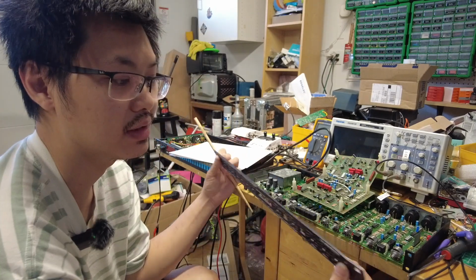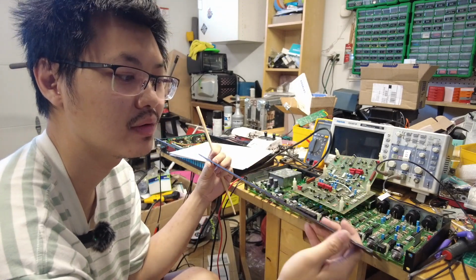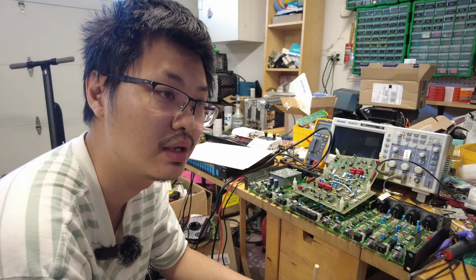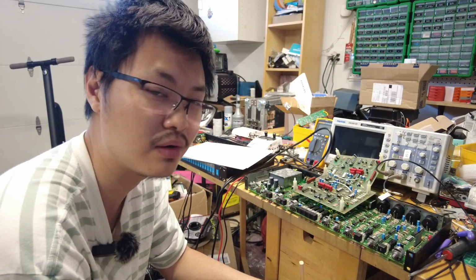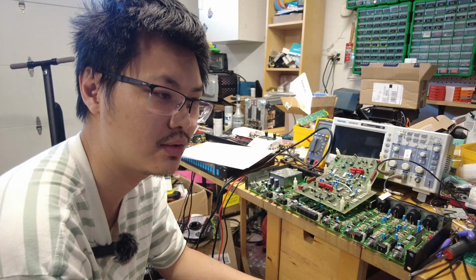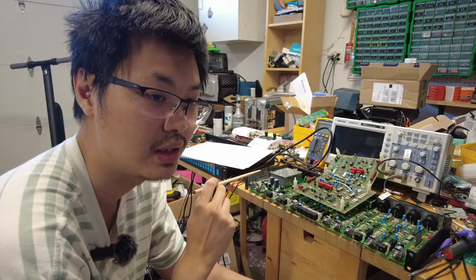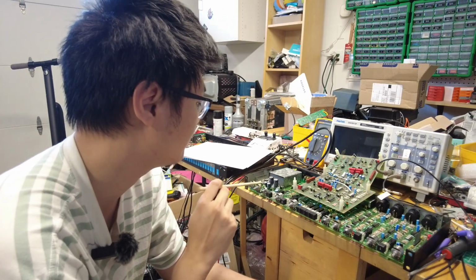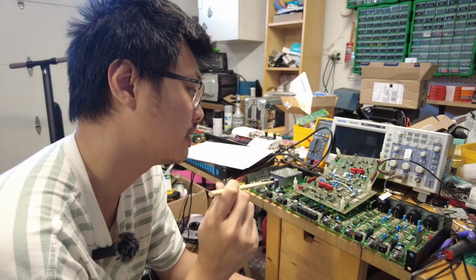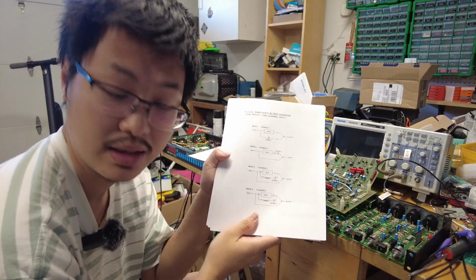When I received it, it was a little bit bent over here, so I have to straighten it up using the vise. So, pretty cool. Now Mike mentioned to me that the problem was the chorus is not lush anymore, or even overdriven. So I had a chance to take everything apart. I figured out there was an issue with the voltages. The voltages were quite finicky on this side, and I got a chance to figure it out with the service manual.